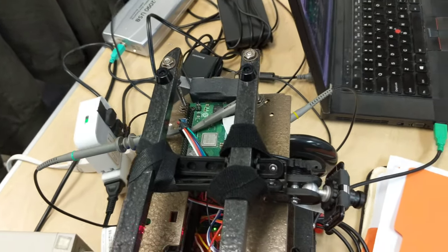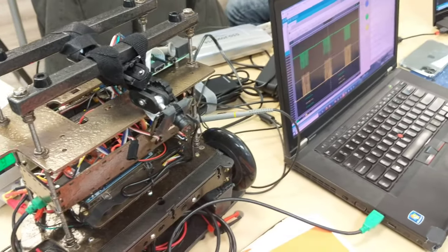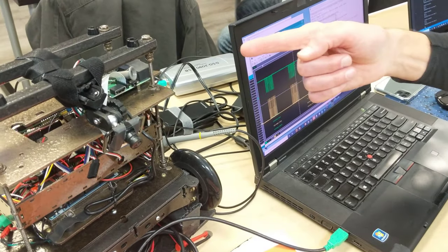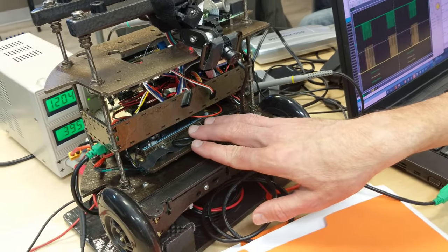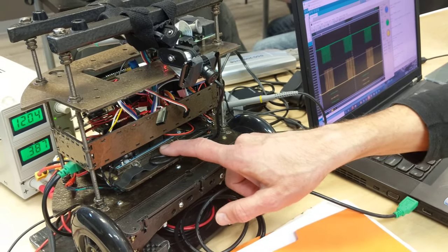The SPI port is interesting — it's synchronous communication. The way it works is that you define one end as a master and the other as the slave. The Arduino has SPI support and a standard library, but it only works for the SPI port as a master.